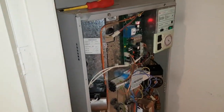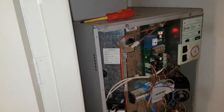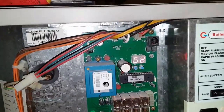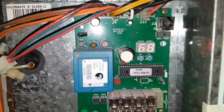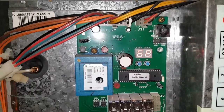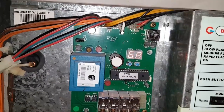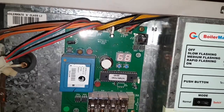We're now coming into the house. They've got a Gledhill Boiler Mate. What I've done is just pressed on the PCB and I'm just checking the store temperature, which you can see flashing at 68, just seeing if that's increasing. Once that gets up a bit more you should be able to get hot water quite reasonably, and central heating.